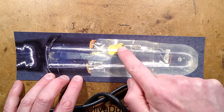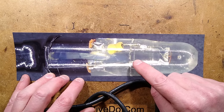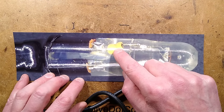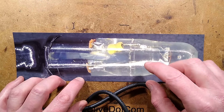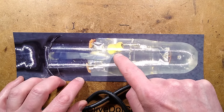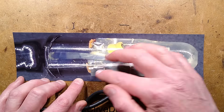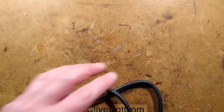The cables come in and they're soldered to the LED, then it's filled with resin and the LEDs are plunged in. It must be messy — I wonder how that's done in the factory, because if you've ever tried doing this yourself it makes a mess. The cups would be slithering off everything and would have to be locked in place. There is the resistor, and there are typically about eight resistors in each section of these LEDs, and I can prove that with a thermal imaging camera image. It looks like an eighth-watt resistor. The cable comes in going via that resistor through the LED, going out on another cable and then going along the string until it gets to a junction.